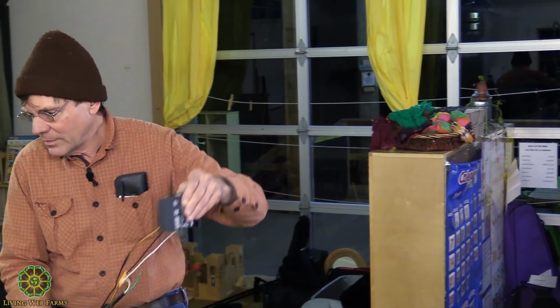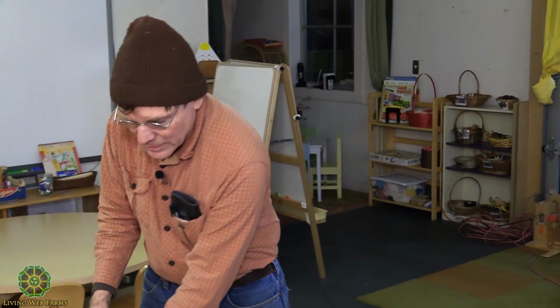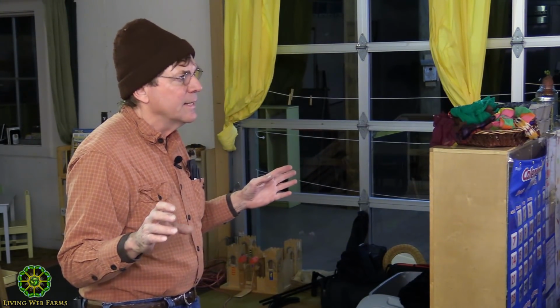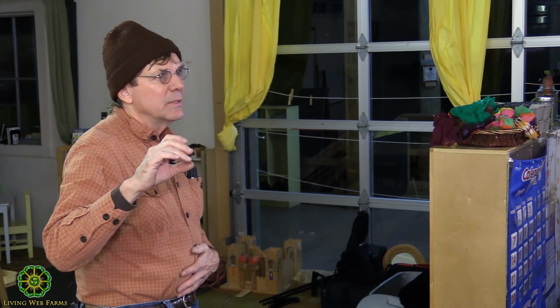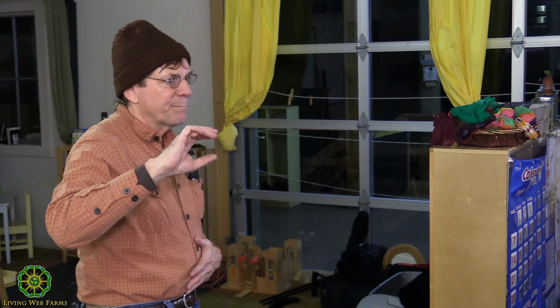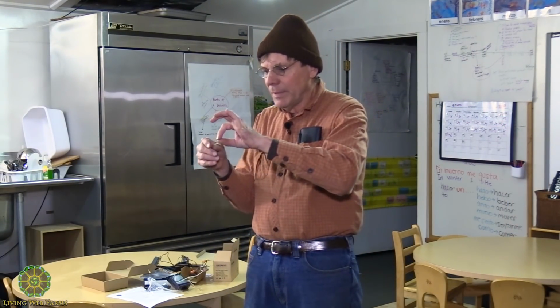The water bath is controlled with a conventional Dayton, although there are many other manufacturers, but ours happens to be a Dayton. It's a 0 to 130 degree thermostat, what they call a remote bulb thermostat. So you put the thermostat on the wall, and there's a wire, and then a little bulb hangs into the chamber, and you set that at whatever temperature you want. If it's 95 degree water you want, that'll control the heating element until the water gets up to 95, then it shuts off.